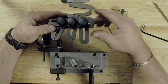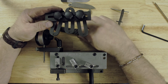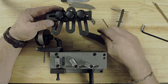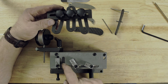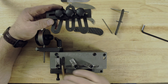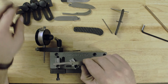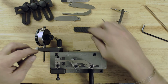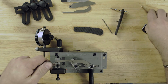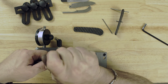A simpler version of this is I make a top plate that will go right over this section. You can put your hard pattern down over that, drill your holes into the top plate, and then you always have it. The top plate also has the cutout so that you can move your spring and set your blade. Now it's ready as before to go in and finish out the tang, the spring, get everything where you want it before you're going to finish the knife and put it together.